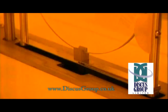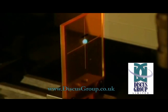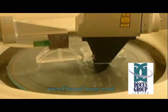We now carefully remove the glass substrate from the machine and bake it in an oven for 30 minutes. A laser then transfers the client's content onto the glass to become a glass master. The glass is washed again with de-ionized water and a developer is added to develop the data recorded.